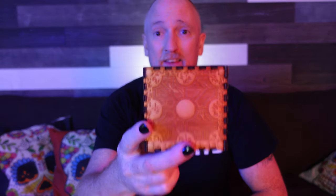The reason knowing what your laser kerf is is important is it allows you to get a friction fit like this. This is not glued in at all. Also, knowing your kerf will allow you to cut finger joints like this.